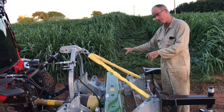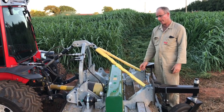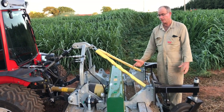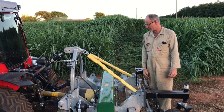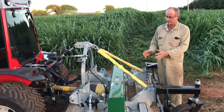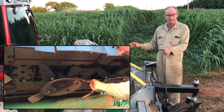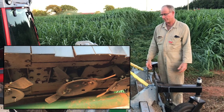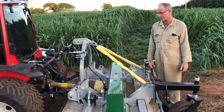But you've got the momentum of the other two, they want to keep going. And you can't have a push drive or a slip clutch in there. So therefore there's problems, isn't there? When one wants to stop and the other two want to keep going, usually something will give, something will break. Now that remains to be seen about the Cyclone, whether their gears are strong enough, and looking at their spindles, they look very heavy duty, and there's a lot of weight in the blades, so hopefully the blades will swing and absorb that momentum. The blades will swing, it's a question of how much weight and momentum is retained in the spindle itself.